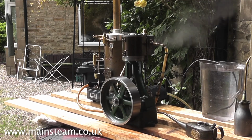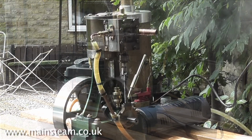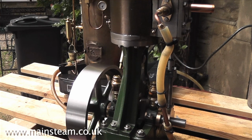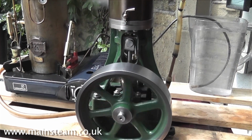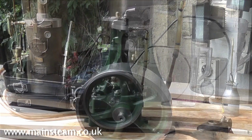If you use a small boiler with a large bore steam engine, it will of course run, just not very well. The thirstier the engine, the more steam you need to generate to make the engine deliver any usable power. The boiler's heat source is your primary target to get right if good engine performance is to be achieved.